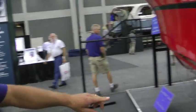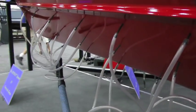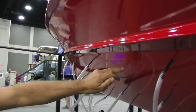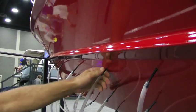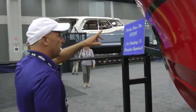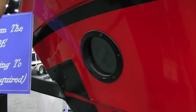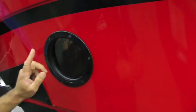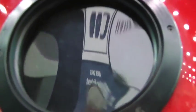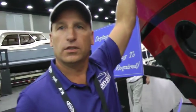Here we're illustrating drying out the bottom of the boat. We use a little bit of a smaller hole — our tips are smaller, less intrusive. We can dry them out this way or, like I said earlier, we can go from the inside. We have an access hole here to show you actually drying the boat from the inside and not getting into the deck. If you look up in there — go ahead and put that camera up — you can see we're actually drying from the inside. That way we do not have to do any damage to the decking at all.